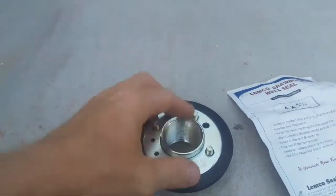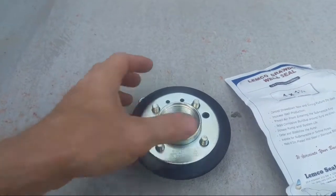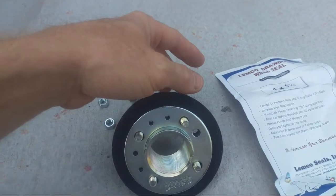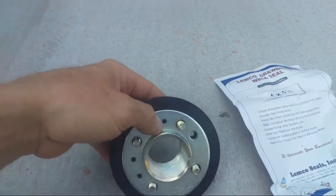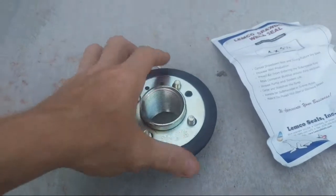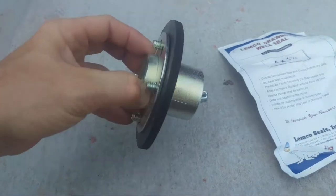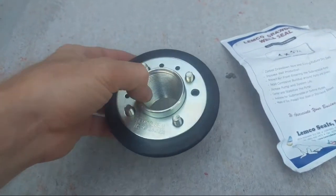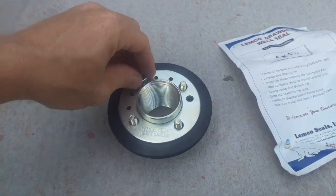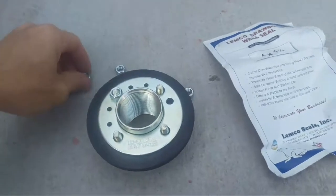that tubing all the way up to your well seal, so that you could take your air compressor, and I wouldn't put more than 5 or 10 pounds of air at a time in, and you'll notice the pump will start coming up the well, so you won't have to drag the drawdown seal all the way up. I mean, the pump will literally lift itself. I've done 5 horsepowers with that, and man, it's insane. It's almost the way you should be doing it.